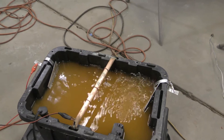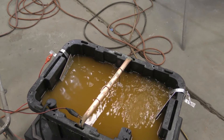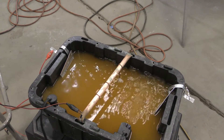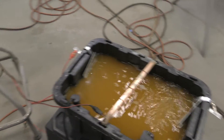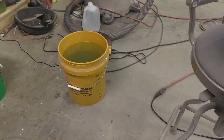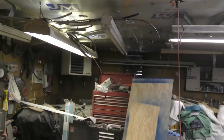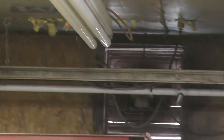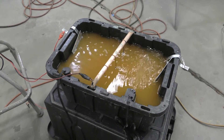After coming off the acid, that's when you come over here to where you're plating. You plate for about 20 to 25 minutes, according to how nice and thick the plate coverage is that you want on there. Then I've got my own separate rinse for that. I normally have this a little bit more organized, but you see I've got my fan going back there because I don't want to be up in these chemicals — it's not bad chemicals, but it's enough that I want to run my fan.